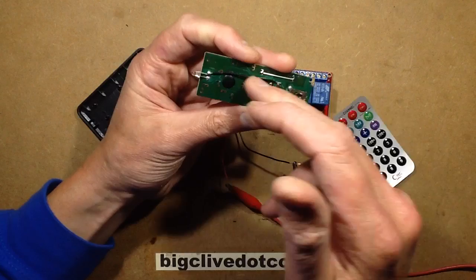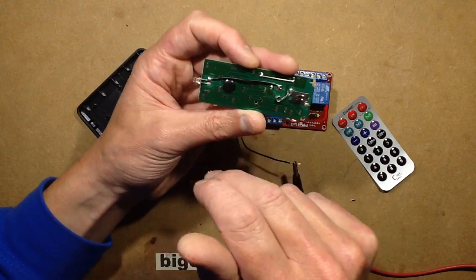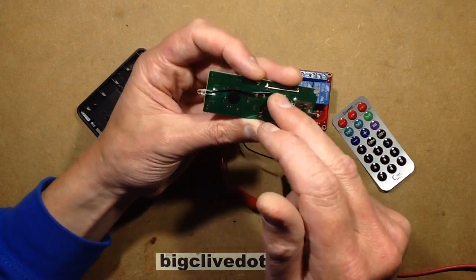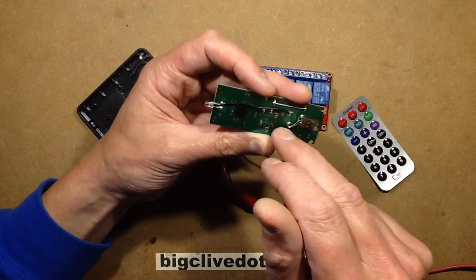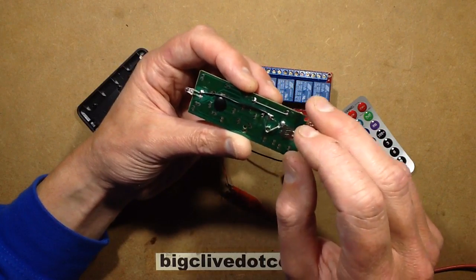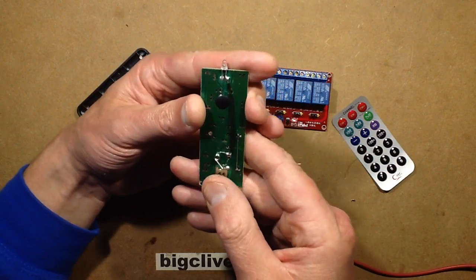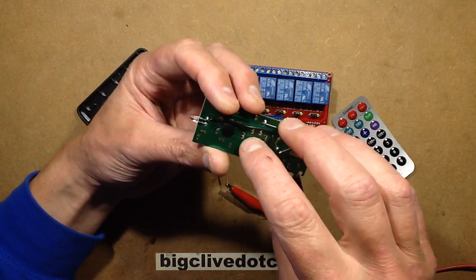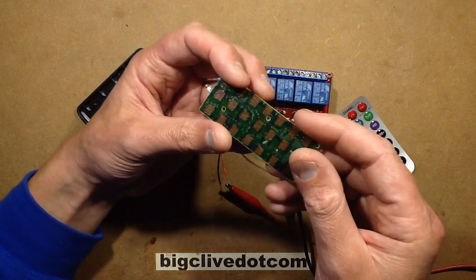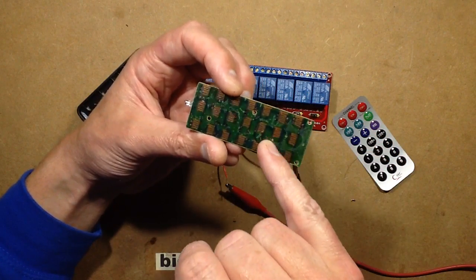So I thought, well, let's just check obvious things like the connection, follow the track through, and then check it for continuity. And I did with the meter, and there was no continuity. And I thought, oh, right, okay, that track's somehow broken. And I fixed it, and then it started working, but not all the buttons were working. Looking closer at it, it really became obvious. There's a huge crack in this. It's obviously been squished at some point in transit, and it's broken lots of tracks.